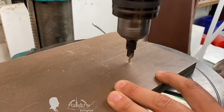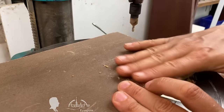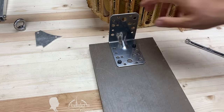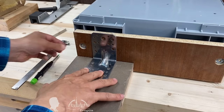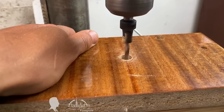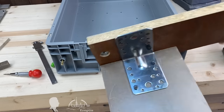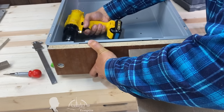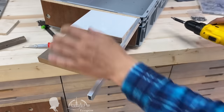Now these two movable parts need to be attached to the KLT box — in your case it would be on your workbench. I had two unused metal brackets on hand and decided to use them. If brackets weren't available I would have used dowels and pocket screws. The load on this joint is not significant, so I fix the bracket using only two screws on each side. When marking the mounting holes it is important to position the bracket so that in the working position two laminate cutoffs fit flush with the tabletop. Otherwise, during miter cutting, thin sheet material won't press against the tabletop, which is not acceptable. Using only two screws per mounting point — the necessary minimum — means assembly takes seconds. You can double the quantity, but then assembly and disassembly of the miter system will take twice as long.